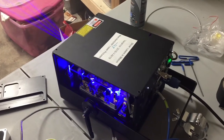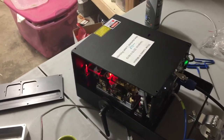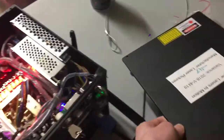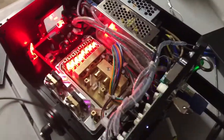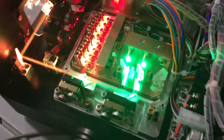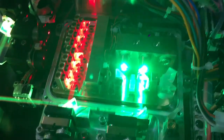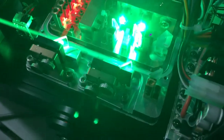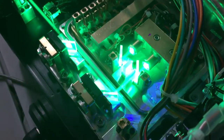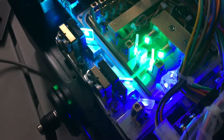This one and the other one - it's exactly the same. These are the main projectors I used to draw those lines on my house on Christmas. I'll show you inside by removing the lid here. It looks very complicated at first, but really there are only a few key components. The centerpiece is this array of laser diodes that are all combined using optics and then special dichroic glass that allows you to selectively combine certain color channels.